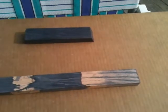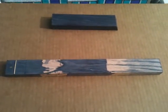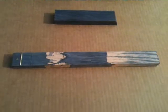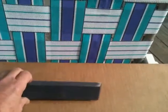My thinking was that because both the vinegar and the water raised the grain, the alcohol wouldn't. It also did not absorb very well. I'm going to try lacquer thinner — I just haven't done it yet — to see if it will give a better result without raising the grain. So that's how they work on something like oak, with a real high tannin content. My conclusion is that the good old steel wool and vinegar method gives the best result, and it works really, really well.